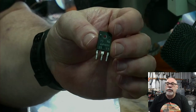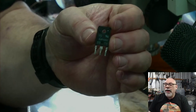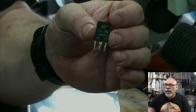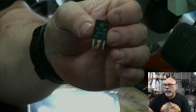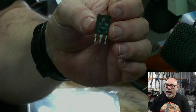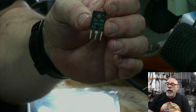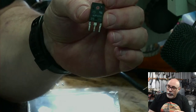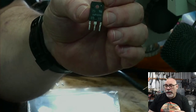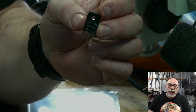As I've said to people many times before, when you've got a CRT with a problem, generally the first thing you look for are cracked solder joints or switches that have gone bad, because often old CRTs have little push button switches, and after being pushed off and on squazillions of times, they go bad or they get cracked solder joints. You get cracked solder joints on the large components. So cracked solder joints are always the thing to look for first. Then, of course, you've got capacitor failure. There's always potential for capacitor failure on those things.